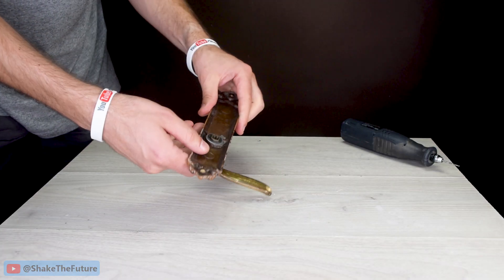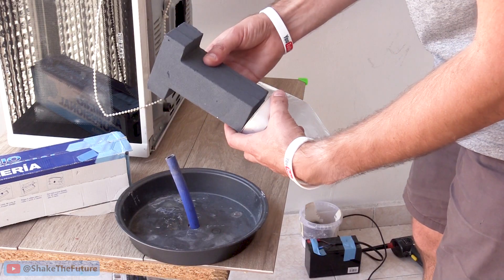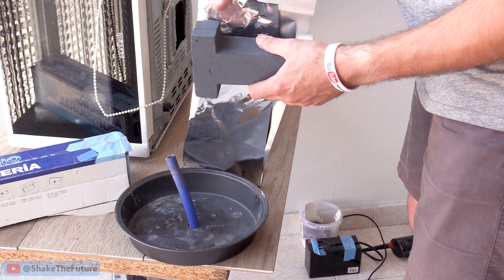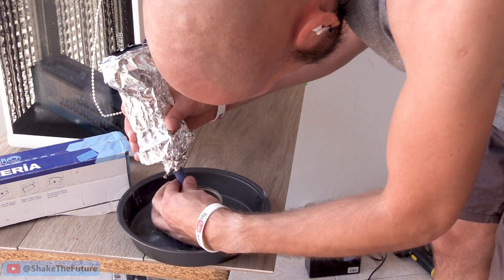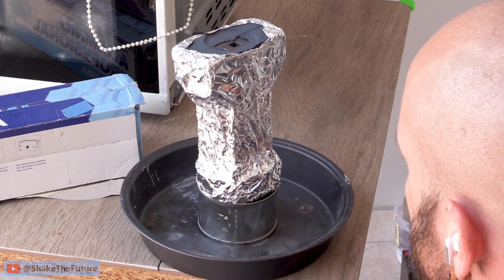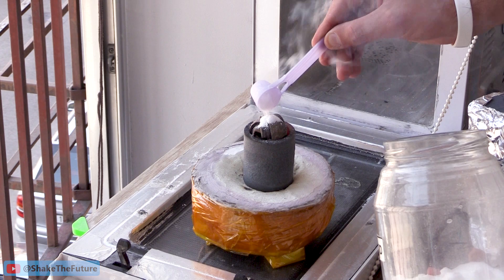I'll be casting the hammer handle from brass door handles. I cut them into smaller pieces so I could fit them in the crucible. I wanted to pull vacuum while pouring the metal just in case it helps. I'm using my vacuum casting station, which is basically a mocha pot funnel attached to a vacuum cleaner — pretty simple but it works. Just like before I preheated the mold and added a bit of boric acid. Boric acid helps to collect the slag and I can confirm that it works.